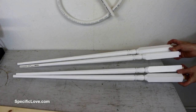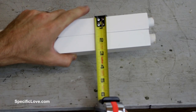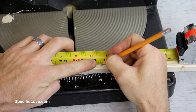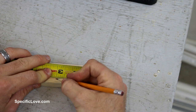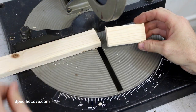For the legs on this project, I will be turning 4 balusters or spindles into table legs. Each of these legs measure 1 and 1/4 inches, so I will have to shorten each of the furring strips by an additional 2 and 1/2 inches, for a total length of 6 feet 9 and 1/2 inches. The true width of the 1x6 is actually 5 and 1/2 inches, which means the ends of the table will need a 3 inch furring strip between each of the legs.